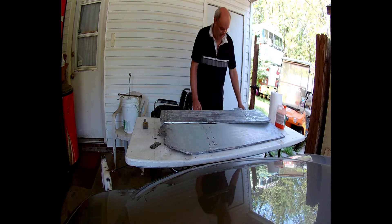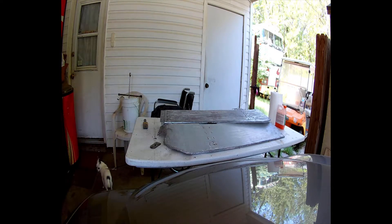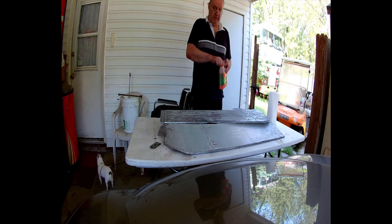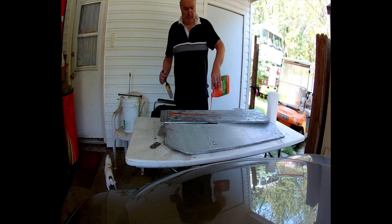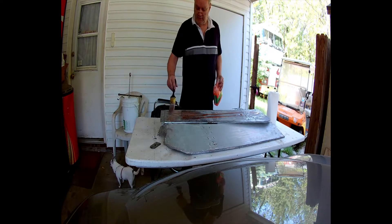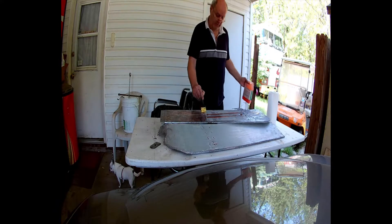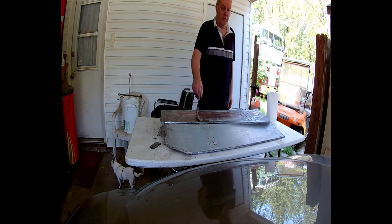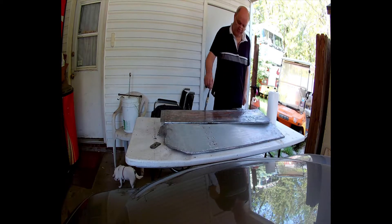I think that's good enough for another coat. I'm going to go ahead and put another coat of this Citrus Strip on here and let it sit for a few hours this time. Hopefully it will soak down to the base. Now, this is not the way they tell you to do it, but I rarely ever follow instructions. They say you should put the Citrus Strip in some kind of a container and submerge the piece, but because I'm doing such a large space, I think that's redundant. So I'll just pour it on and spread it out evenly.